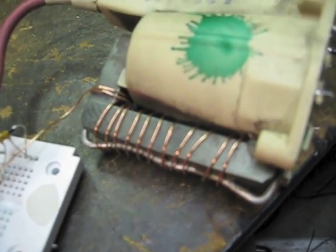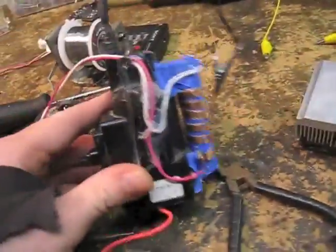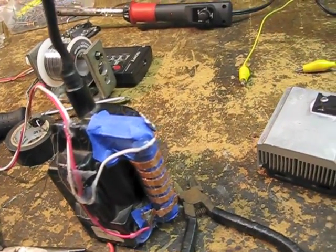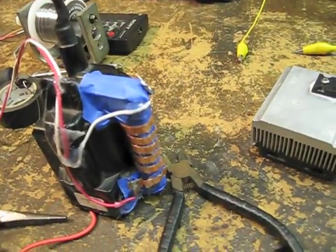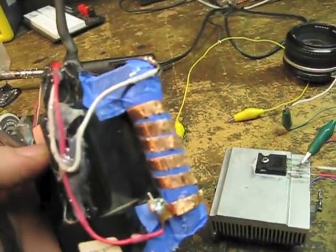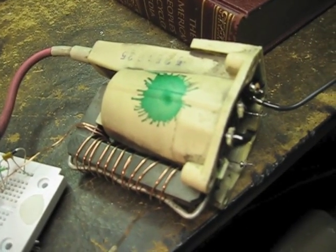Here's the flyback transformer — it's super old. I have maybe 8 or so turns of magnet wire around it that goes straight to the breadboard. I started off with this flyback transformer using a tutorial — the link is in the description, along with the Arduino code. This is not my original schematic; I did tweak it. I used this transformer, followed his instructions, and bought copper tape from eBay and wound up the transformer. But plain old magnet wire worked way better for me, even with this older, crappier flyback transformer.